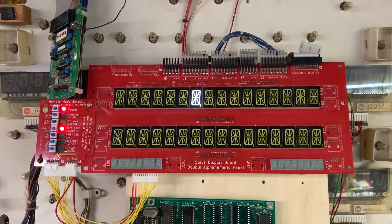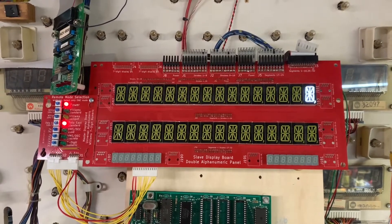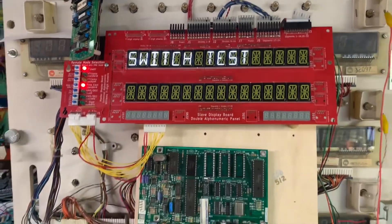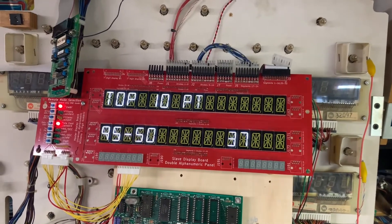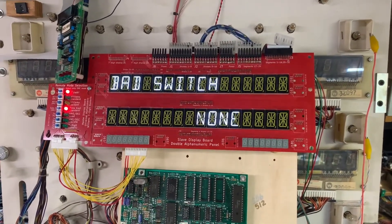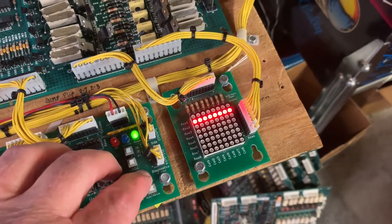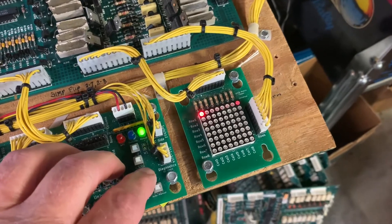I don't think there is any reason for me to go through this whole thing. Data East at this stage of development was really slow with some of the tests they had implemented. Here is where we might have had some difficulty. I have got my Victor-designed switch tester and I am going to go across the diagonal of the switch matrix proving that all rows and columns are now operating — excellent. No active switches, no bad switches. We can look at all of the lamp matrix operating at the same time, then we can do the returns and the drives, and we could even do individual lamps.